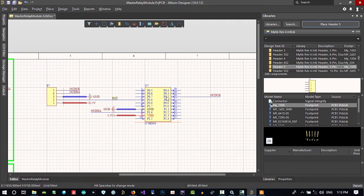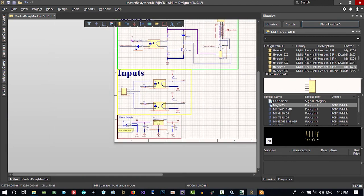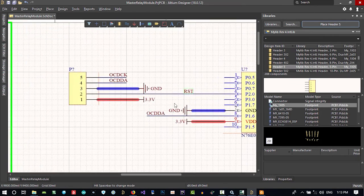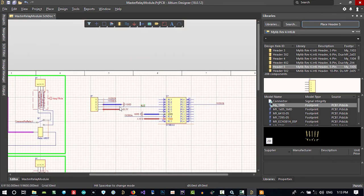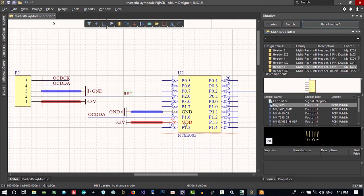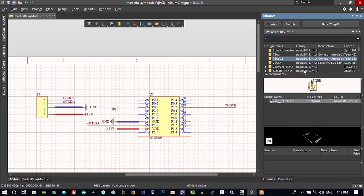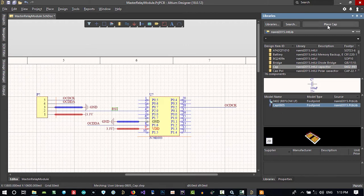With this we can program it. We don't want it to be connected to power to program it, because we bring out this power and ground, so we can program it even if our board is shut down. So for this power pin, we should put a bypass capacitor. Let's go to my new library and search for cap and use this size. Let's place it here. We need two of them. One is 100 nanofarad, and another one I think 10 nanofarad or 1 nanofarad. We can change it in future.